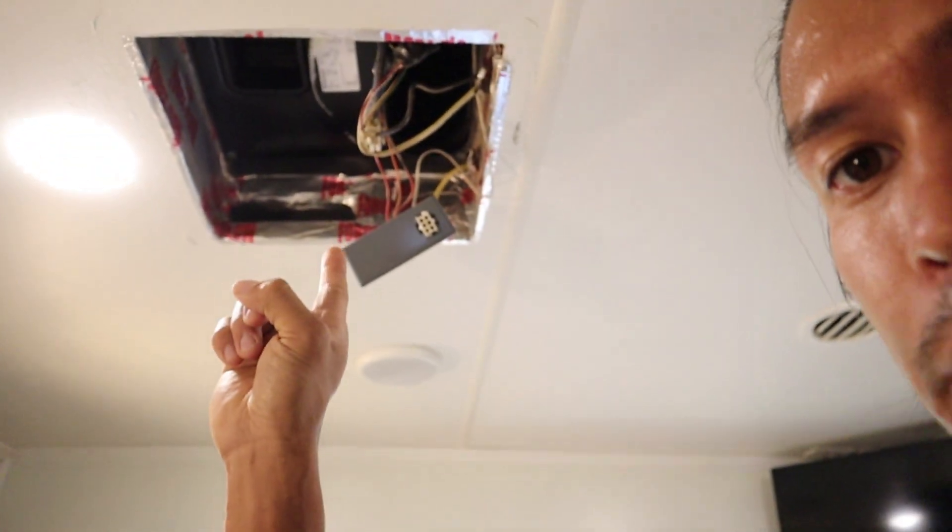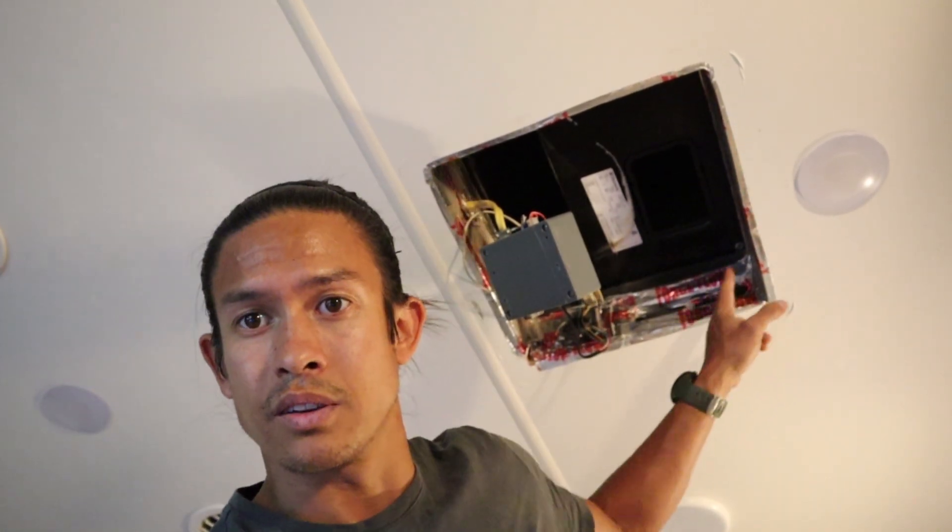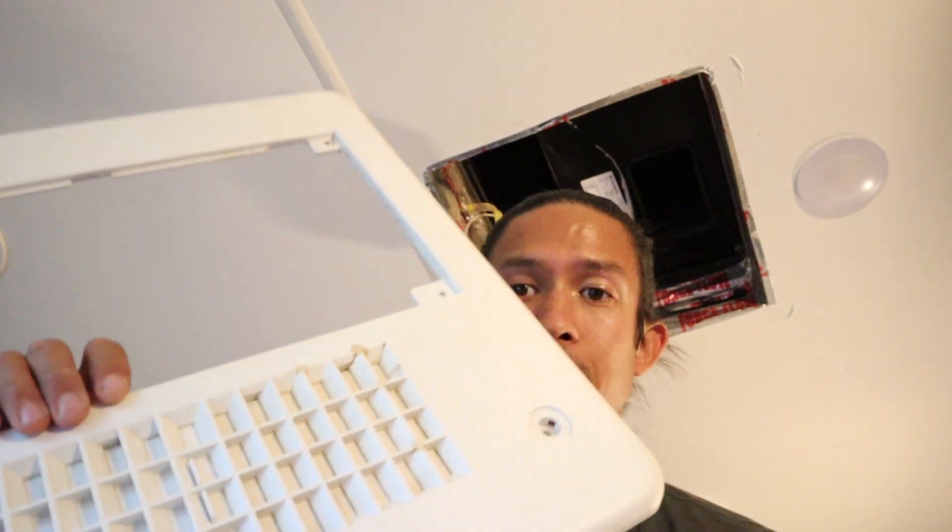The AC coils have been cleaned, the filter has been cleaned and is drying, and the coils are drying off. Now's a good time to start working on sealing this opening and making improvements to smooth the airflow. We're going to do a basic upgrade using just the tape and the Reflectix foil — really cheap. I'm not going to go super detailed because that other YouTube video did a great job explaining exactly how he did it. Essentially he lined all the walls of this hole with Reflectix, cut to fit, with overlaps into the ductwork sealed up with the metal tape.